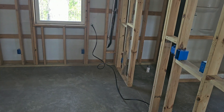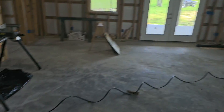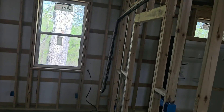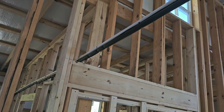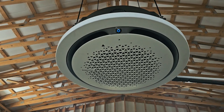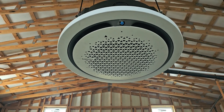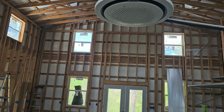Line sets go down and out. I've got a wire temporarily run through the wall across the floor so I can test it out because this building does not have electricity yet. You can see how we ran the line sets and the drain on that side of the wall — they're going to fur that out or build a box around it to hide it. We didn't want to cut through all those joists and the homeowner didn't either. We may paint that drain line black and may also use a round black fascia panel instead of the white one. Right now you can see the blue icon changing from inward to outward and back — that means it's in swing mode, throwing air spot, mid, wide, and back to spot which is straight down.